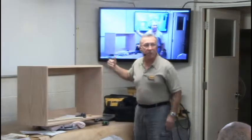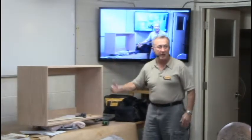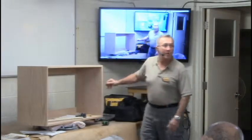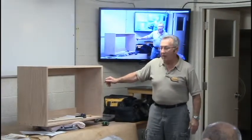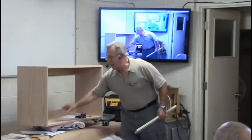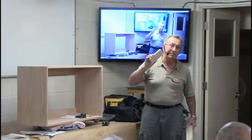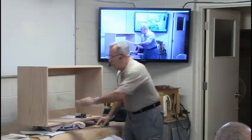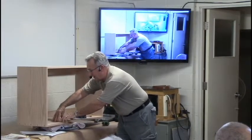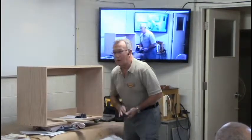On one side there's a sixteenth inch relief, and a sixteenth inch relief on the other side. So whatever the width is here, you basically want it to be one-eighth narrower. I'll tell you how you figure out how long to make this piece of wood — it's really simple. You get one stile and you put another stile there, and you want it 20 inches.